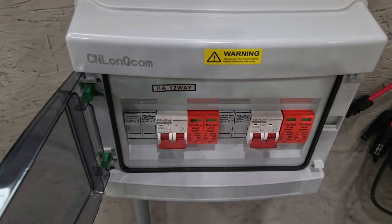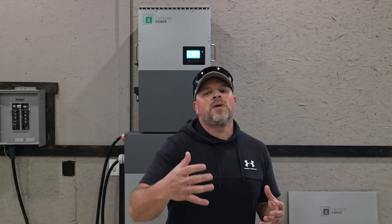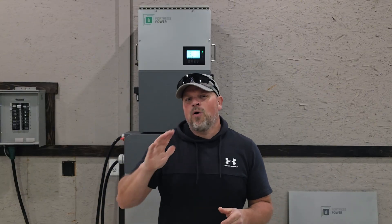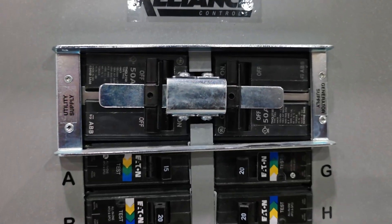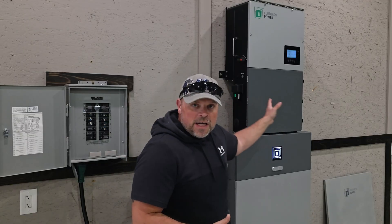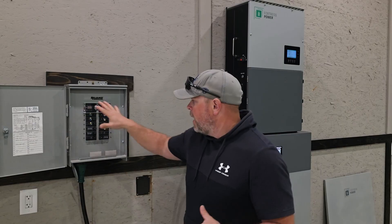We turn off this disconnect and this disconnect as well. Now that we have that out of the way, let's turn on some of the most energy-consuming systems that I have in my studio here. I have a hot water heater that should be pushing somewhere close to 5,000 watts. We have that mini split that's 240 volts, which should be pushing close to 1,500 or 2,000 watts. We have the other mini split, and then I've got some tricks up my sleeve to push it over 10,000 watts. I may go up to 12,000 watts if I start feeling confident, but I'm pretty sure I may trip the main breaker in my 50 amp transfer switch — and that wouldn't be any fault of the inverter itself.